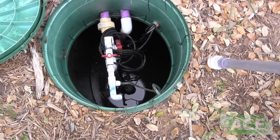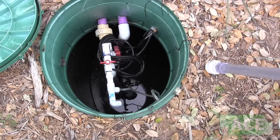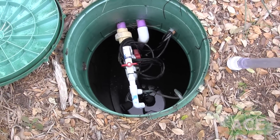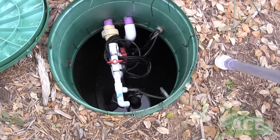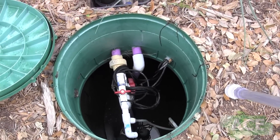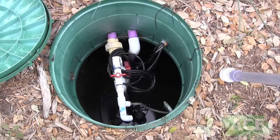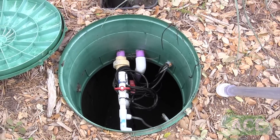You'll see several floats in the pump tank. The water level rises, toggles a float, and it pumps out. If the water level comes up too high, it'll hit the second float, which is not controlled with the timer — it's like an override that helps pump it out. If it gets to another float in there, that's the alarm.